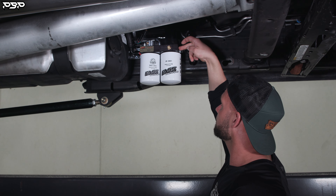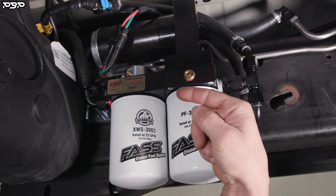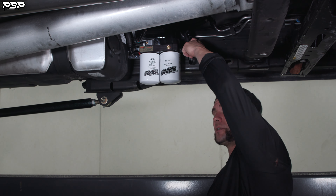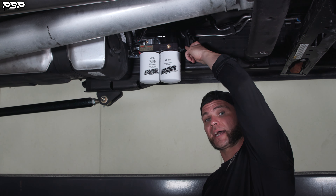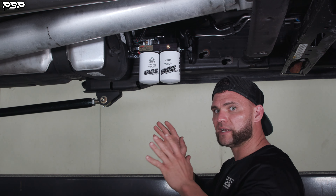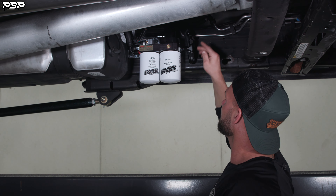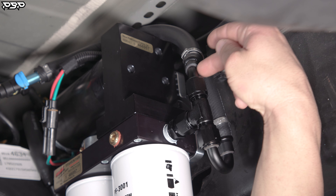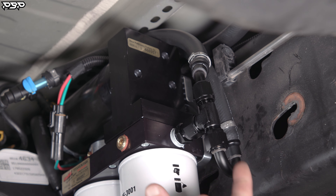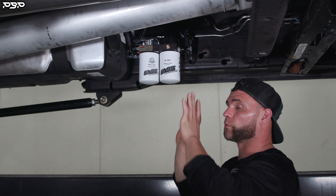On here, we have thread paste on a fitting. That fitting needs to be spun into the fast pump and tightened all the way — don't break it off, tighten it all the way. Then this fitting directly connected onto it: tighten it on there but only hand-tight. Why only hand-tight? Because we're going to have to push hoses on these and we may have to maneuver it. All fittings hand-tight besides the ones that have paste on them. This is a T, so it's hand-tight. On the top side of the T we have a 45-degree angle fitting. On the bottom side, put a 180-degree fitting — it has a big U in it. All these are hand-tight and we're ready to proceed.